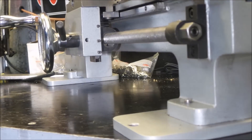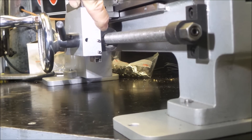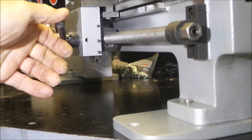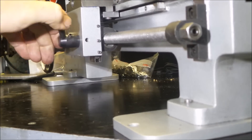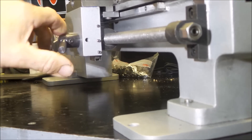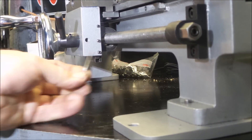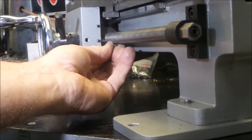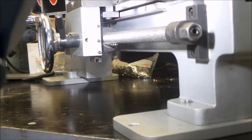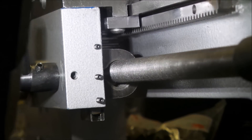Looking into the engagement area, you can see there is no clearance on the top — the top half nut is actually resting against the lead screw — and we have a substantial gap underneath. When the half nut is engaged, the lead screw is being pulled down by the top half nut as the lower half nut tries to engage. I can slide a three millimeter drill bit into the recess at the bottom, which gives a good indication of how much difference we have — three millimeters.